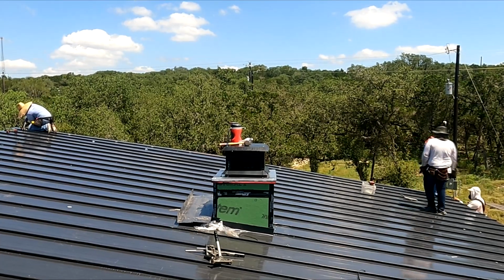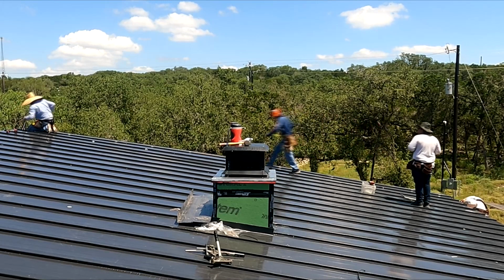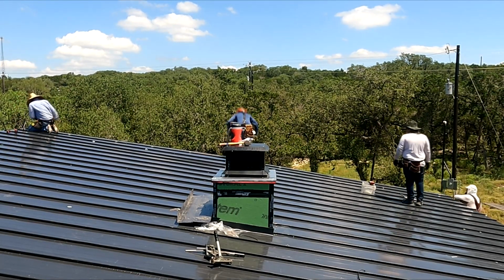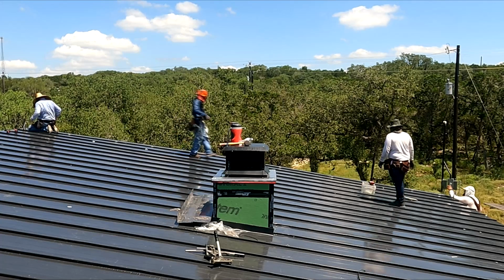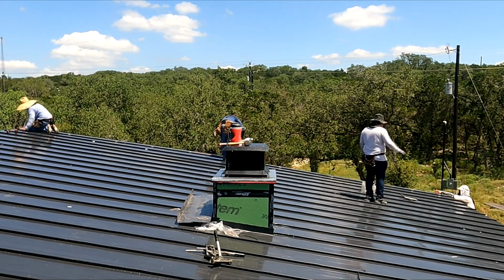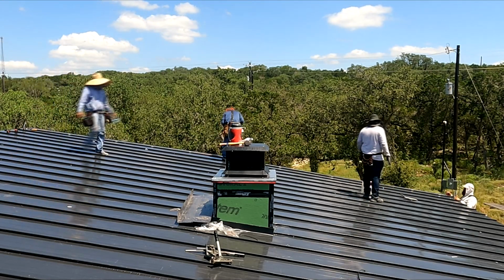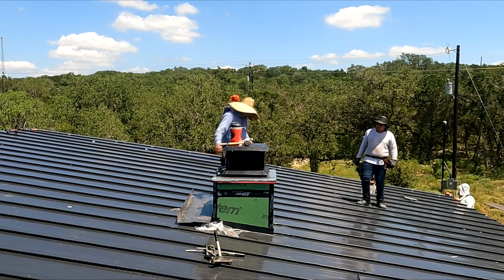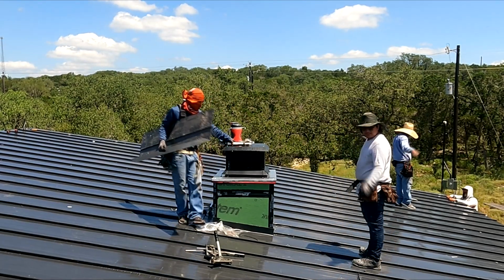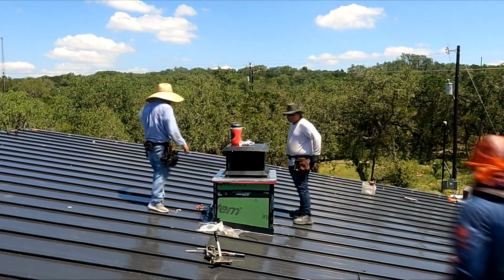But anyway, next in order will be more roof. And then I'm going to continue doing the rough-in plumbing. I'm going to start with the venting of the piping, because that's going to be the harder part. Although I do want to do the wet piping, which is all the drains from the shower, the sinks, and the toilet, which go into a main stack. So I'm going to try doing that, and then the venting for those as well.